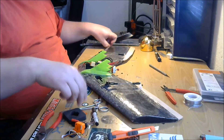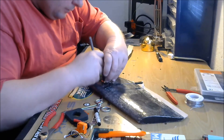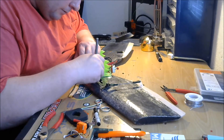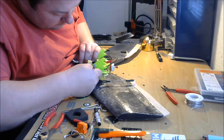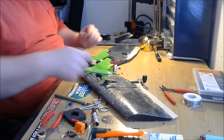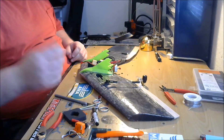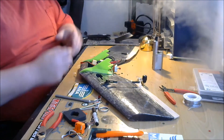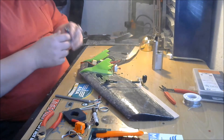I didn't cut quite enough to get the wires onto that plug, so I need to add just a little bit more — just cut that out. Now I've got enough room for that plug. We need to get the wires from here over into the battery bay. We're going to heat up this rod — remember, hot metal looks exactly like cold metal, so be careful — and push it through to make a hole so we can pass those wires through.